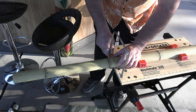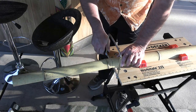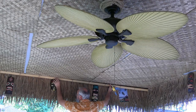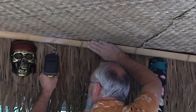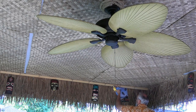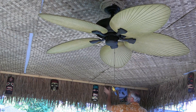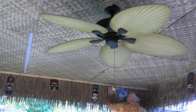Maybe two or three backward strokes if you're using a coping saw. Don't force it through either — let the teeth do the work, and you'll wind up with a really nice, smooth piece. I want to line up this seam right here, nice and flush. I really don't want too much tension on these. Bamboo will split over time, so when you put it up there, you just want it to hold. Don't put so much tension on that screw that it puts pressure in there — it will split it over time. You can increase the longevity by not doing that. The first row is in.